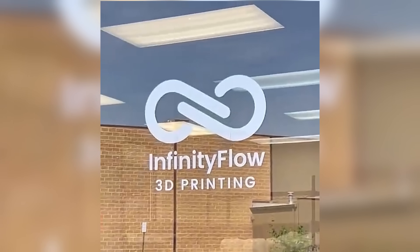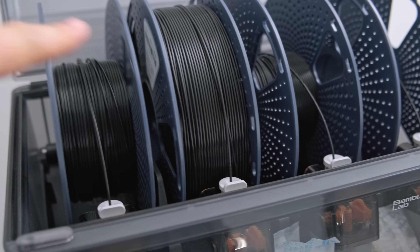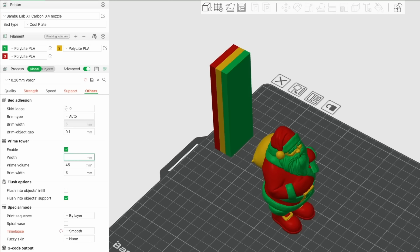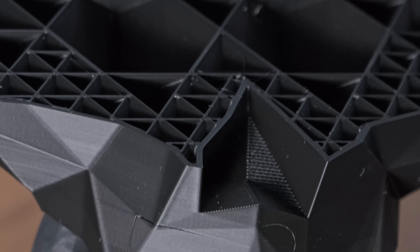The only company I know of that has actually managed to do this properly is Infinity Flow with the S1, but they don't ship out of the US or Canada and I have absolutely no idea when they even will. There is technology like the AMS from Bambu Lab that has their auto refill feature, which is really the only reason I bought it. But after using it for a few days, I realized it kind of sucks — primarily because it doesn't operate with a purge tower and has no way to repressurize the nozzle, remove those annoying blobs, or just make a clean print. It's really just a roll of the dice as to whether the refill happens on an outside wall or on the infill. So now I'm basically left with a really overpriced spool holder.